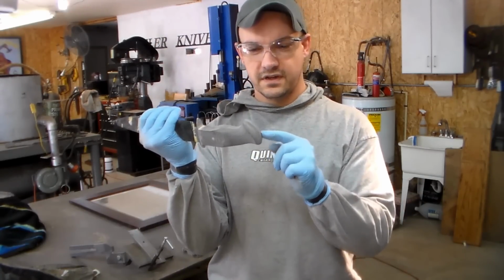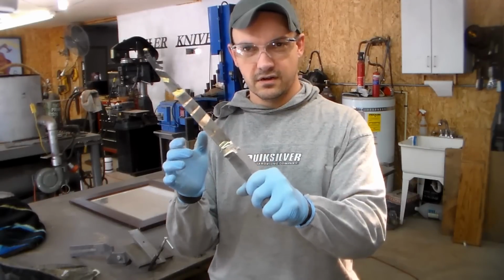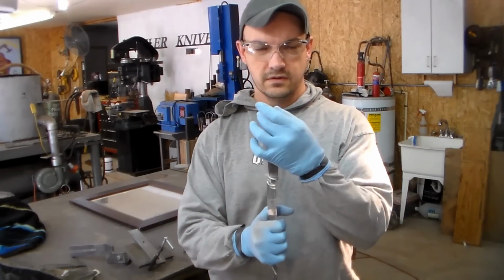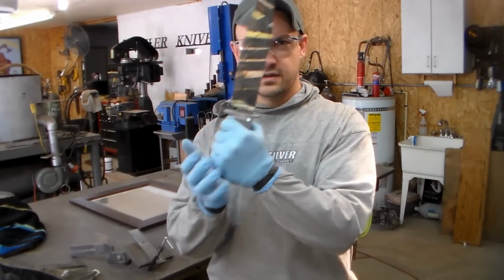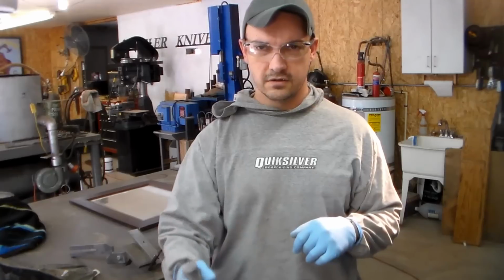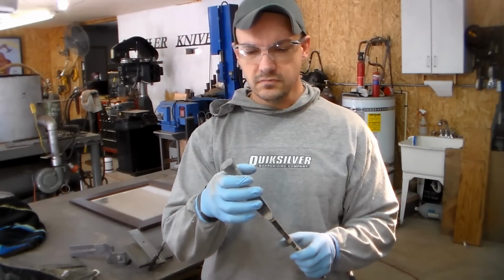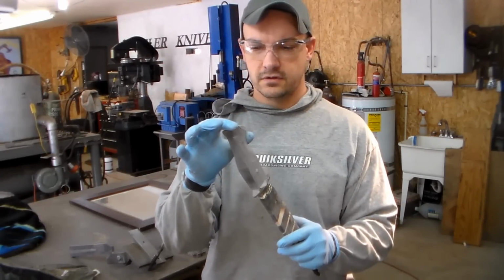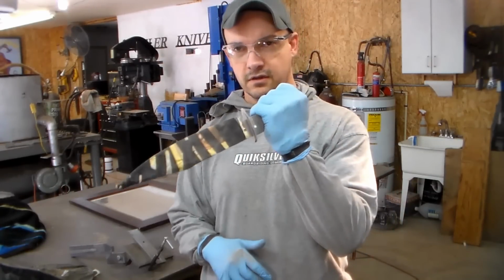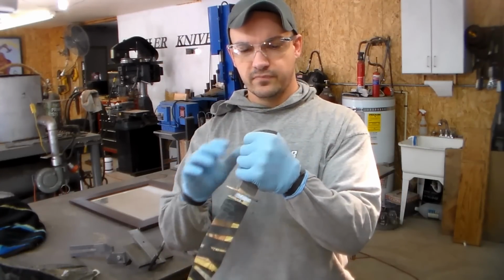Do you have enough of a set of hips on here that it's going to be secure in your hand, but not so much that it's hitting you in the palm of your hand and uncomfortable? One place where I constantly check is the width of these hips, that's really what's going to keep this thing secure in your hand for snap cuts. If you whip it around and do a back cut, this fat part on here is what's going to secure this thing in your hand. But you don't want to go so far that you make it goofy, where yeah, it's never going to come out of your hand, but it's uncomfortable, it's unwieldy, or it won't allow you to do other grips. One that's easy to overlook is a reverse grip. If we go way too fat on this, then this will be uncomfortable.